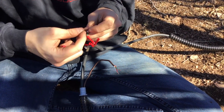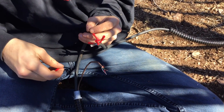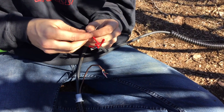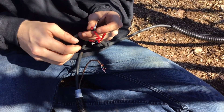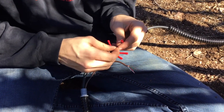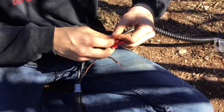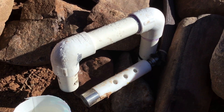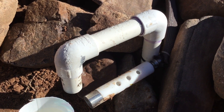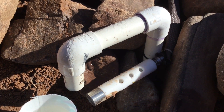What's slowing us down right now is having to make the connections between the auto-sampler, the switch in the channel, and the REM. This is kind of painful to do — it just takes a lot of time and these wires don't crimp together very well with those joiners. We do have a little field soldering kit, but the battery runs out really quick — we get maybe one or two solders out of it. I think what we're going to do next time is use a PVC T-fitting, which will allow us to better hang that sampler tubing at the elevation we're interested in relative to the trigger, and also help us avoid having it end up sucking up dirt out of the channel.